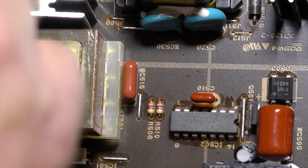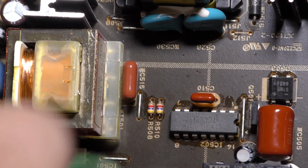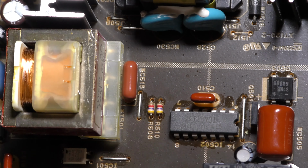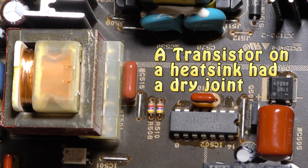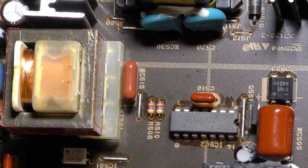These are rectifiers, transistors, that's a little FET down there. Tested all those, everything seemed alright, couldn't find any obvious fault. There's a ton of surface mount components on the other side. Anyway, cut a long story short, these transistors over here, one of these, the soldering didn't look fantastic. Tidied up the soldering and that's it, Bob's your uncle, job done.